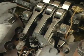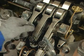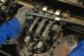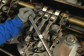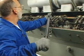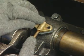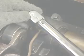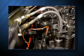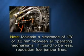Lubricate the shaft stud threads with Texaco Thread-Tex number 2303 or the equivalent. Apply the hardened washers and nuts to the shaft studs. Alternating from side to side, initially torque the shaft nuts to 150 foot-pounds or 203 newton meters on the first pass and to a final torque of 300 foot-pounds or 407 newton meters. Locate a new gasket from the gasket kit and apply the rocker arm oil supply line to the camshaft bearing block and torque the bolts to 7 foot-pounds or 9.5 newton meters. On engines equipped with EUI injectors, after the installation of the rocker arm assembly is complete, once again check that a minimum clearance of 1/8 inch or 3.2 millimeters be maintained between all operating mechanisms and the fuel jumper lines.